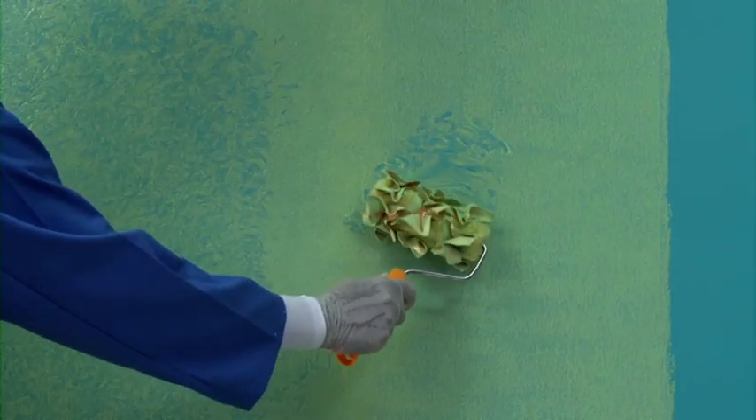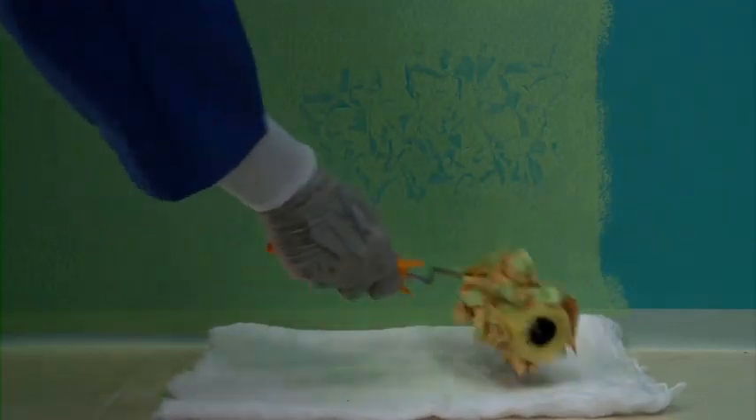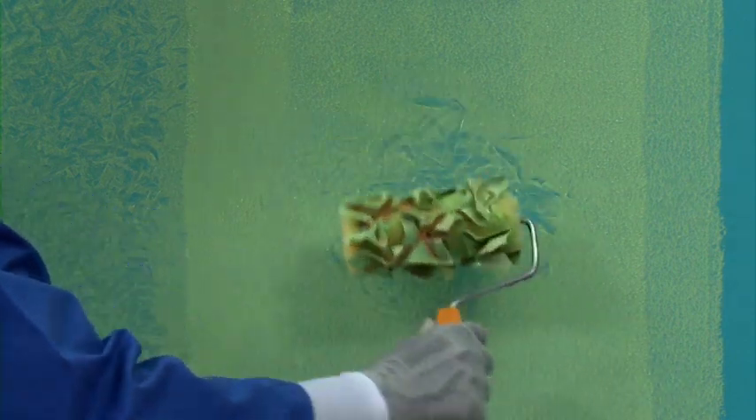Corners need to be taken care of with paper or plastic by crumpling the same. If the roller slips, it means there is too much paint on the roller or a new roller is needed. Clean the roller and re-roll in a cross pattern to correct the same.